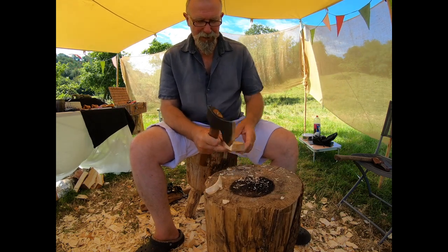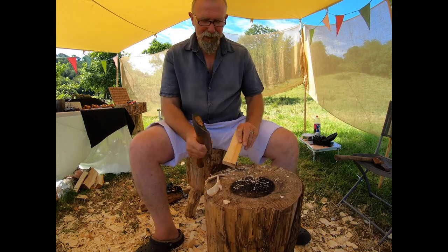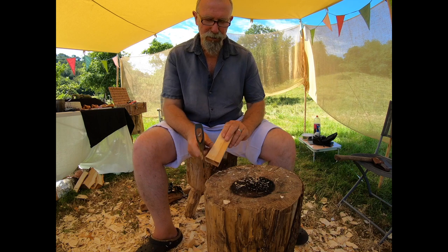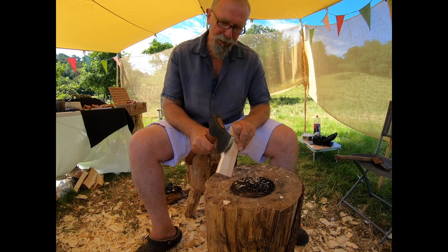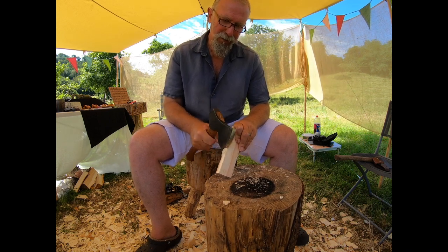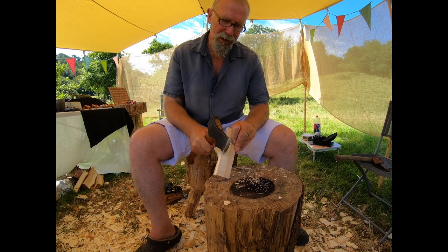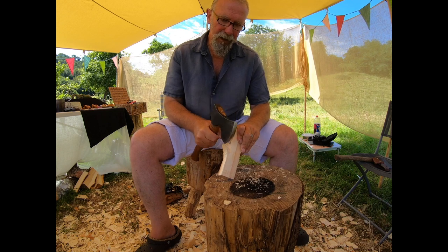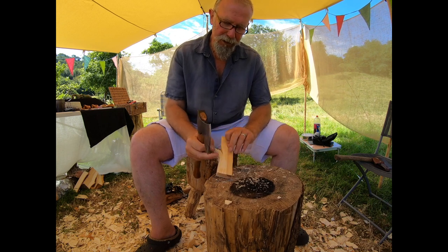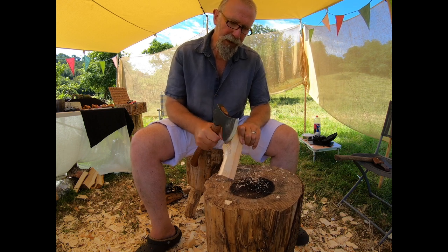Right, I'm on the clock so I'm just going to tidy that up a wee bit more like that and then start. The first thing I do is introduce a bowl — I don't draw spoons, don't have to. At this point we can measure all this later on or whatever. From about there, feather cutting, which I told you how to do yesterday — so I'm making a cut and running the axe in the same cut until you come to a natural stop at the bottom here.